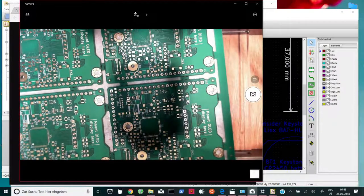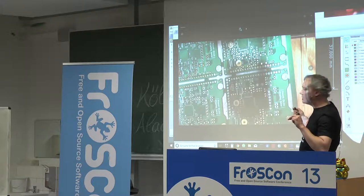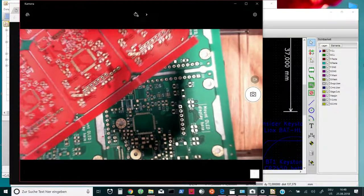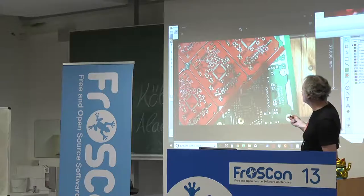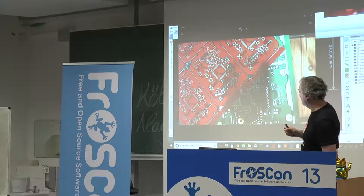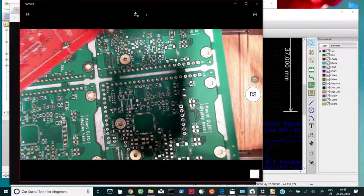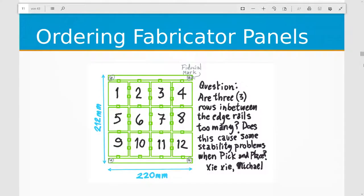All right, so here you can see the mouse bites. And the reason they're called mouse bites, there's all these little holes inside. It looks like a mouse bit into the PCB right there. And because there's holes there, you can break them apart, right? And then when you compare that to this, which doesn't have mouse bites, you can see that there are no spaces and no mouse bites. This is a V cut separation of the panel. And this works just as well, but because there's a V cut on the top and the bottom, it makes it easy to snap off there. See the difference? Anyway, so I'll pass these out so you can get a feel for how panelization works.